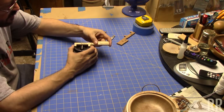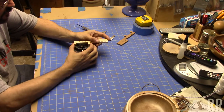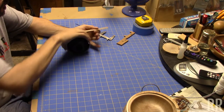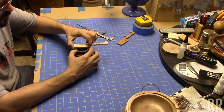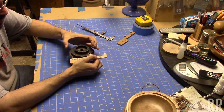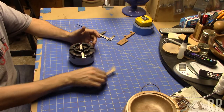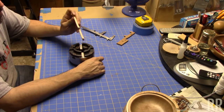squeeze down on it. So if you make a tenon that is that big, a little bit more. And then for the recess, close it back up. That diameter is just slightly larger than it closed in. What you really want is the maximum amount of surface area touching. So if you made a recess that was this big, then you have to open your jaws up quite a lot. And then really the only points that you would have touching are one point on each jaw. So the idea of this is to really come up with the optimum tenon and the optimum recess for this chuck, for this set of jaws.